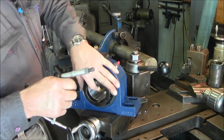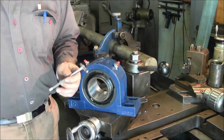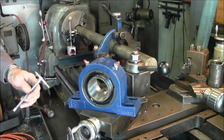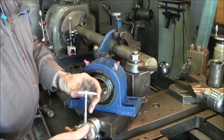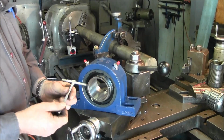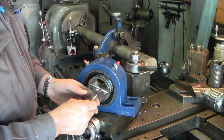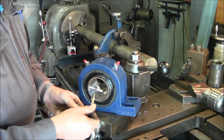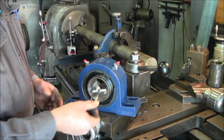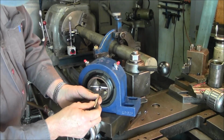Now I want to show you this as well. We're going to take this ring off of here. There's a question of measuring with snap gauges. Now snap gauges, everybody knows they spring in from both sides. I like to insert it into the bore. Sometimes I'll squeeze them, just lightly tighten them so that I can stick them in the bore real quick, so I'm not having to fight them. And then I spring them out.